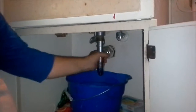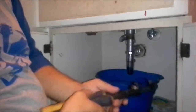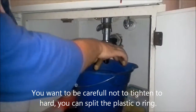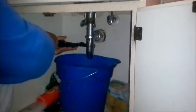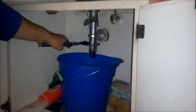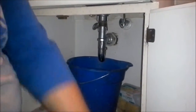This one just goes right back together. Then I use my pliers to just get it snug — you don't have to crank down on it, just kind of get it snug. That's where it sits against that little plastic seal in the ring — snugly, because that's what's going to keep it from leaking. It's not like a pressure fitting on a brake line where you've got to have it really tight. You just have to have it snugged up and it's not going anywhere — just water running through it.